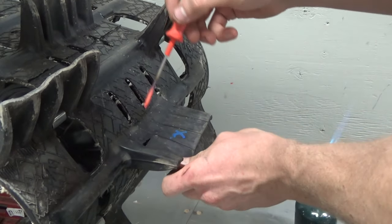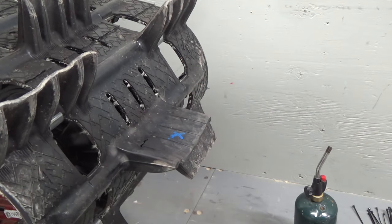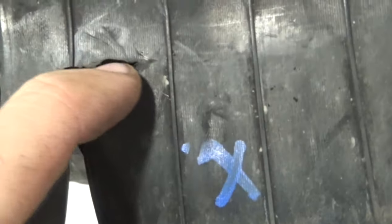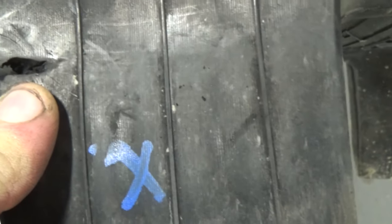That should be nice and hot enough. Before, when I was pulling on this, we could see a little bit of a crack where it was going to continue to the right of the lug. There's a support rib behind here as well. With that burn there was a much deeper propagating crack in there, but I'm going to give it a little more touch-up. I should have done a close-up shot before, but that looks better — the crack doesn't look like it's going to propagate nearly as much. I think I got to the root of it with that melting.